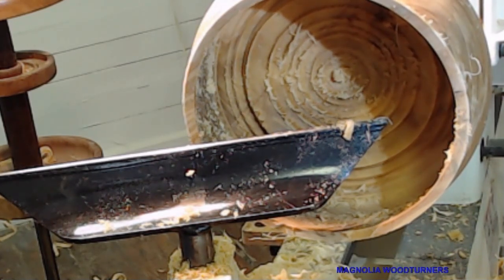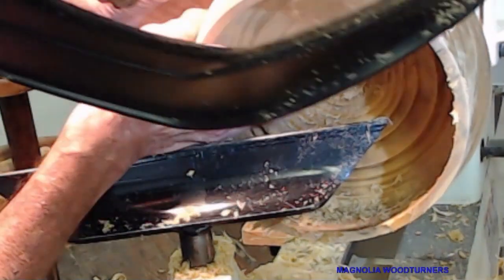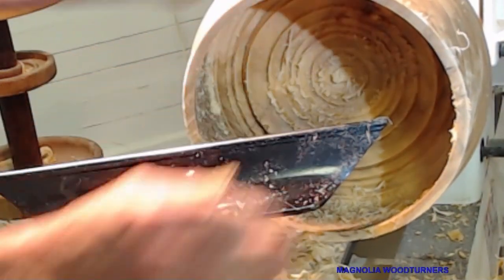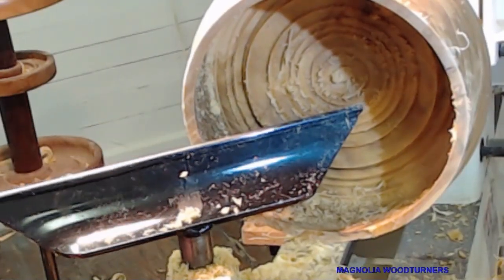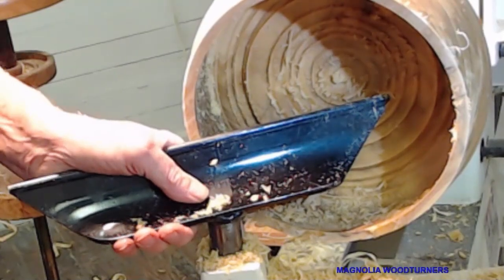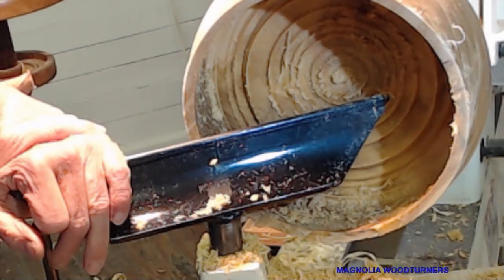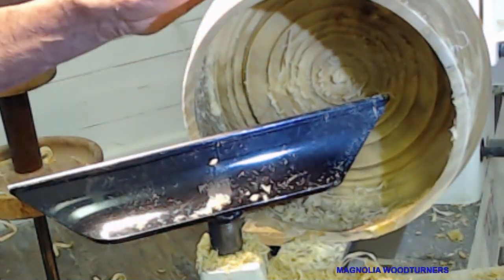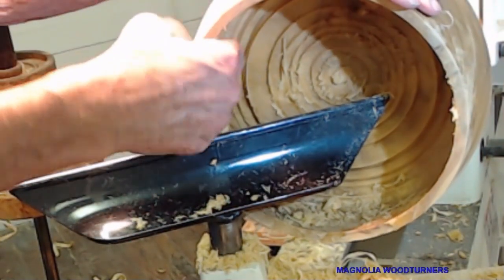The inside thickness, once he finishes turning the bowl, will be the thickness it's going to be, which is the same as the rim, all the way down. Then he turns off the foot, which is the tenon, and decides how he wants to do that. Decide how wide I want the bottom of the bowl. I'm finishing the inside first, and then we'll come back and do the bottom part of the outside. And I'm going to jam chuck it to do that.